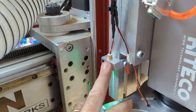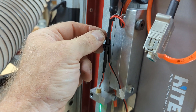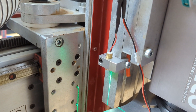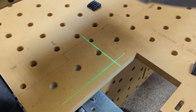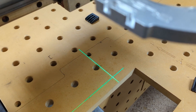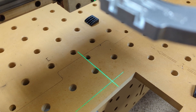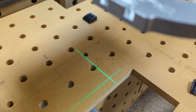The crosshair laser is a 7-to-10-volt device, so you don't want to run it directly off 12 volts or you'll burn it out. What I did was add a 60-ohm resistor in the cable bundle, and that lowered the voltage down to about 9 volts — safely within the operating range. With LEDs, too high a voltage will kill them pretty fast, so you definitely want to stay under their max operating voltage. You could also put a voltage regulator on it to set it at 8 volts, but I had resistors on hand and played around until I found the one that gives about 3 to 4 volts of drop for the current this device draws.